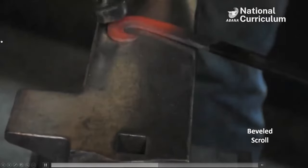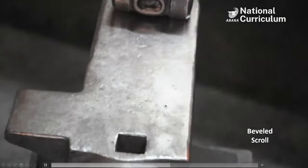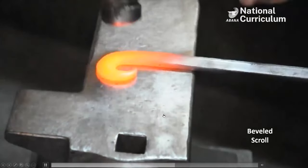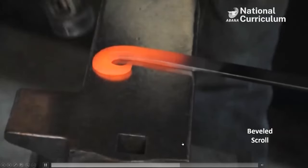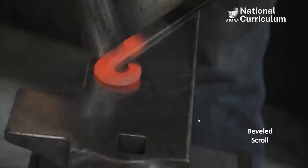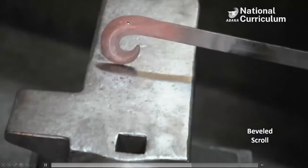Going on the outside here. Now you see it's nice there; I need to work on the tip, and of course here it's still wide open. Take one more heat, clean it off. Sometimes it's good to wait a little bit until the heat goes out of it slightly — you're not moving much so it doesn't really need to be very hot, but you can see much better when it's getting into the reds. Even on the video you can see where the ridge is.